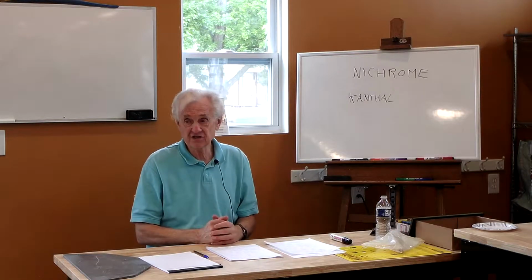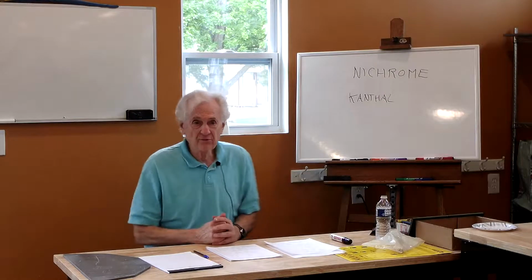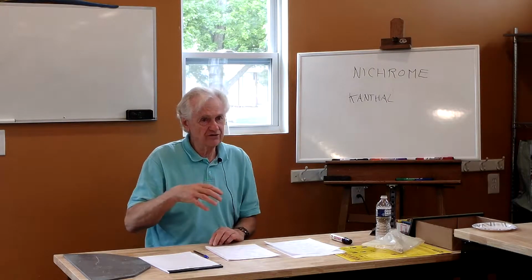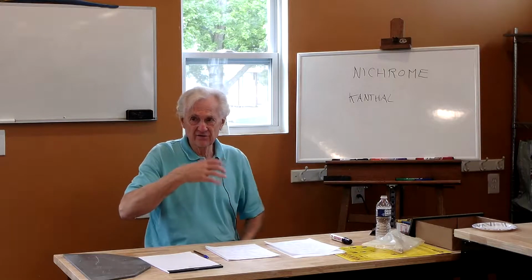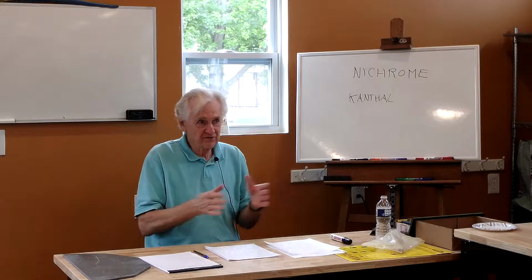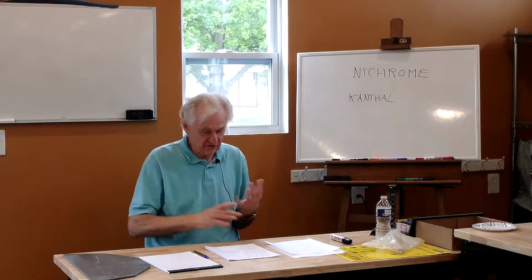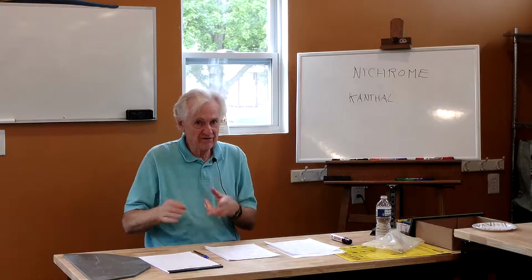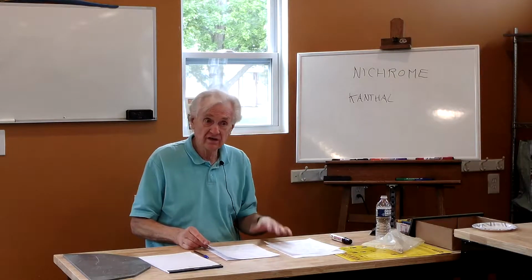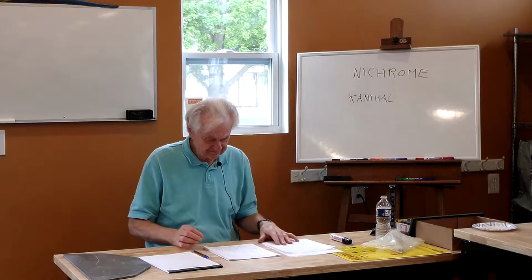And you don't need a chimney. Now, you may need some kind of a vent to get the fumes out of it, like if it's indoors, you may need a vent to get the fumes out of the building or something like that, but you don't need a chimney. So it's different in terms, you still have those three parts, the heat source, the ware chamber, and some kind of a vent, but they're combined or they're used differently than they would be in the wood and the gas kilns.